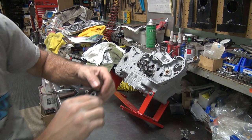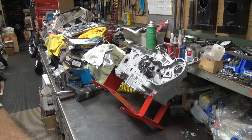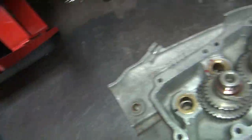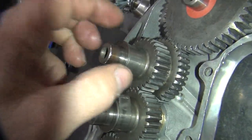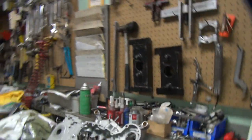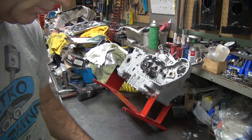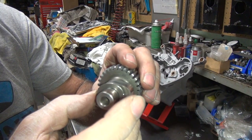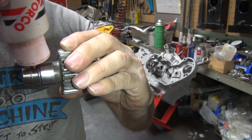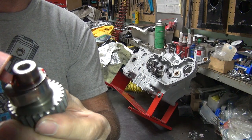We do the same thing with everything else. The cam plate goes in there. The cam plate has chamfers on it right here — those go out, because in case the cam has a sharp edge in there, it will not gall up right in that spot. That's why it's there — it's basically a clearance cut. So that goes like that, then we get all this in here.